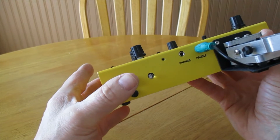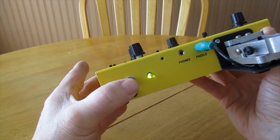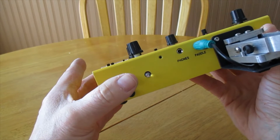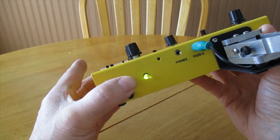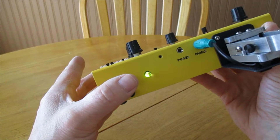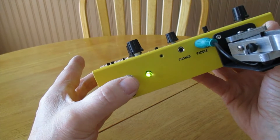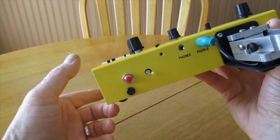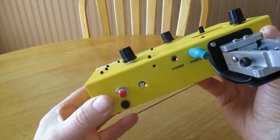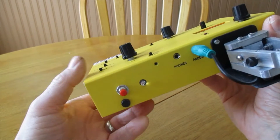In the internal battery position, the LED comes on. I added a battery status indicator: a green light means at least 11.5 volts or more. Between around 10.6 and 11.5 volts it glows orange. If it glows red, you have about 9.6 volts going into the radio. At 9.6 volts you get about 3 watts out; at 10.6 volts, 5 watts; at 12 volts, a little bit more than 5 watts.